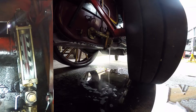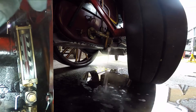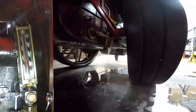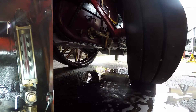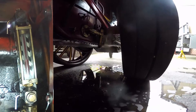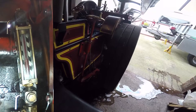Right, that's steam entry sorted. We're going to stop the injection now — steam off, close the water — and let the boiler pressure catch up, and we'll do it again. You might have a slight pass on the valve, so you get a wee bit of a vacuum — you may have to clean the seat — but it does stop after a few seconds. There we go. So our pressure has dropped, so now you just let it build back up.